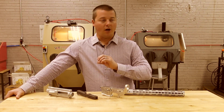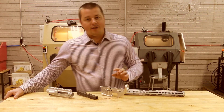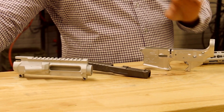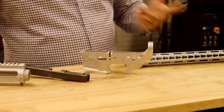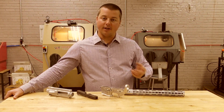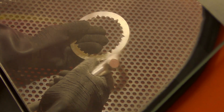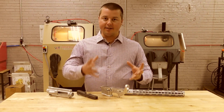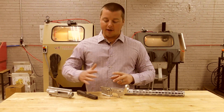Let's face it, these machines all suck. If you guys say there is a great dry blast machine, you're going to have a really tough time convincing me, and you need to show me because I've seen a lot. You can see all the detail in every one of these parts — it's all different, it's all unique. The consistency is going to suffer in a dry blast system because you're spraying like a pencil-fine spray of abrasive, versus back here behind us, we're spraying something like a garden hose with abrasive mixed in. If water can flow around a part, the abrasive can follow it, so you're going to get every nook and cranny.